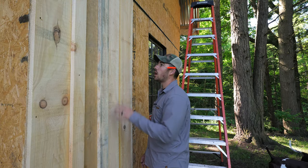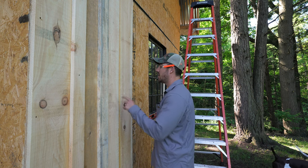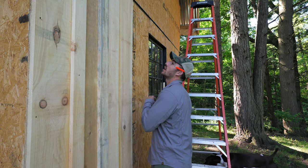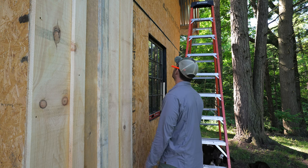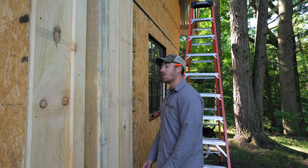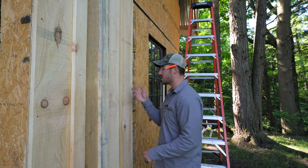Some people will put up all the 10-inch boards and then all the battens. I just find I get bored with that, so I end up doing a few boards and then a few battens — see how it looks, see where I need to straighten things out, and go from there. We'll work our way down, and when we get to the window that's the exciting part. The board and batten goes pretty quickly; the windows take a little extra time.